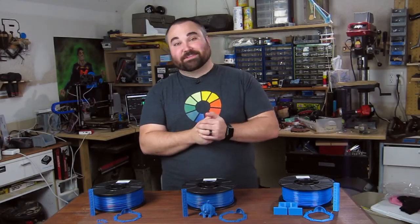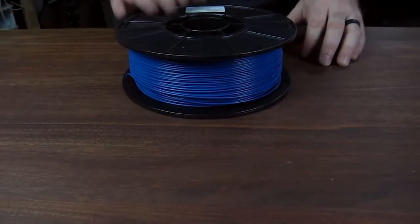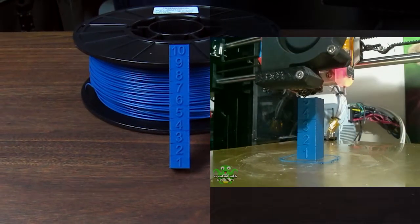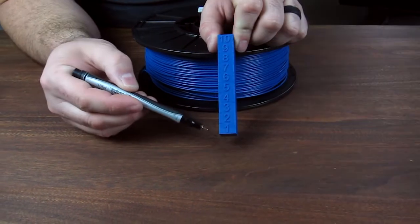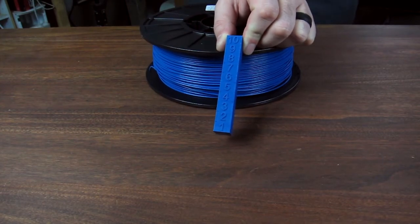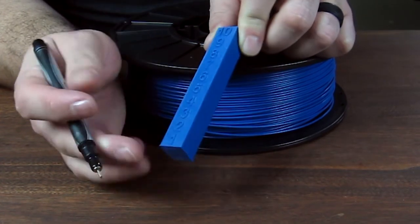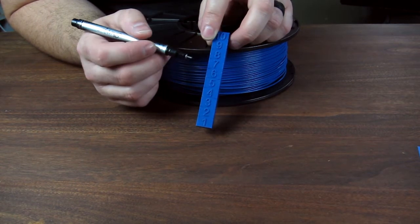The last thing I printed, up until this morning, was the Toner Plastics PLA. My first print is this tower, and as you can see it looks a lot cleaner than some of the other ones — partly because I'm getting Simplify3D dialed in. The temperature range for PLA is 230 down to 190°C. I started at 230 and incrementally decreased the temp, finding the sweet spot for me to be right around 206°C. Really clean lines, nice crisp corners, and that 7 turned out really nice. So 206°C is a good starting point, with 50°C on the bed and Elmer's glue stick.